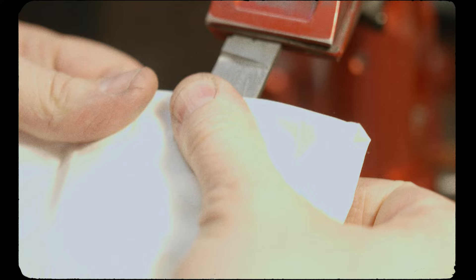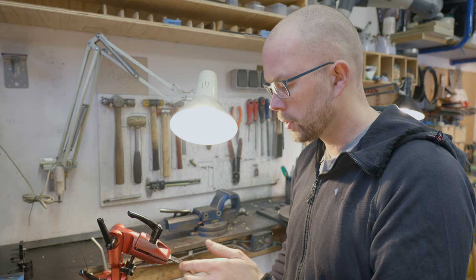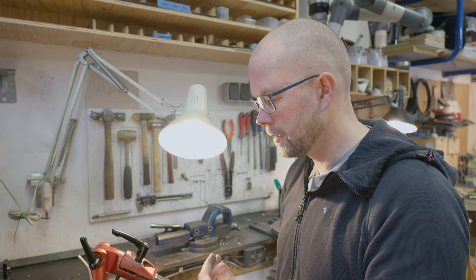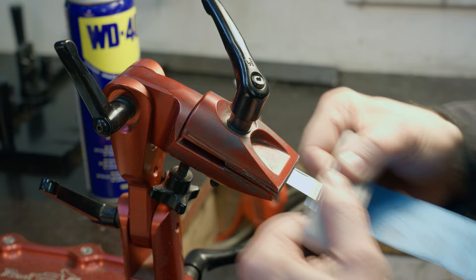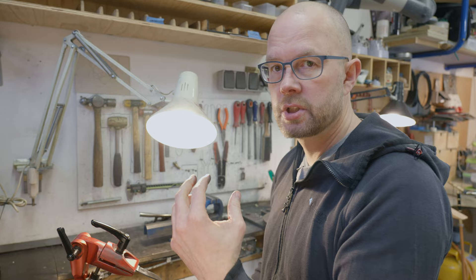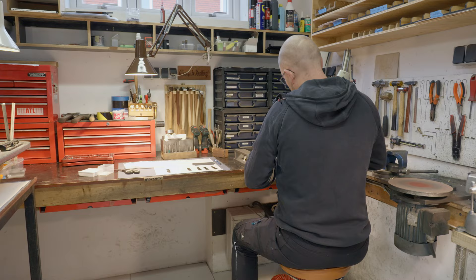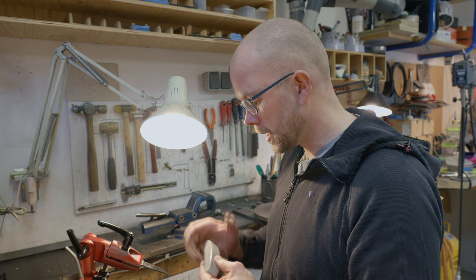The main reason I enjoy deep etching Damascus steel is that everything I make is a tool first and foremost. Damascus is the pretty face of a blade, but I use it as decoration that can't work against the criteria of the knife being a tool. The deep etch gives a finish that's more resistant to scratches during use. On a less deeply etched blade you'll see a ton of scratches the first time you use it, but with Damascus and a deep etch you can use it quite substantially without affecting the finish much. What I do now is polish the top of the pattern, leaving the valleys unpolished.